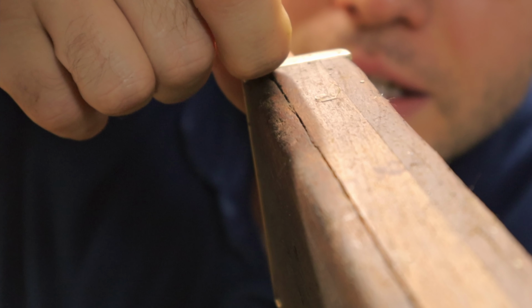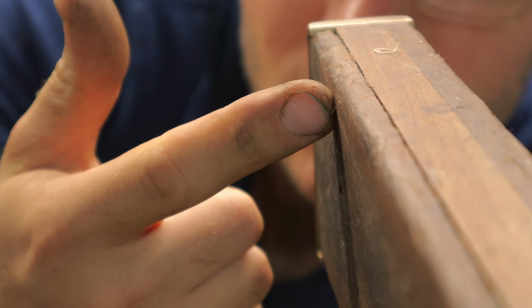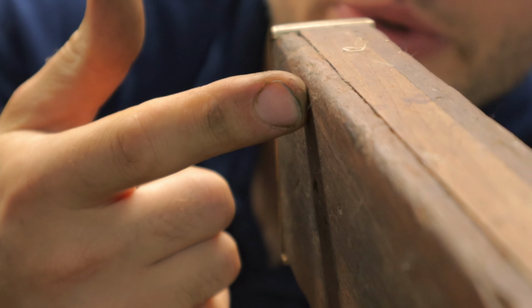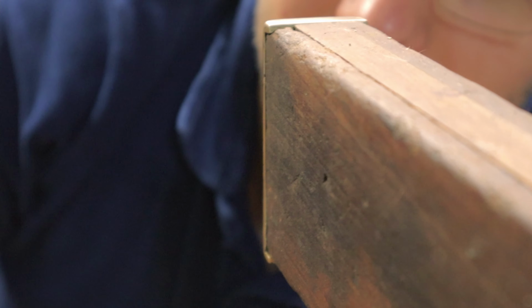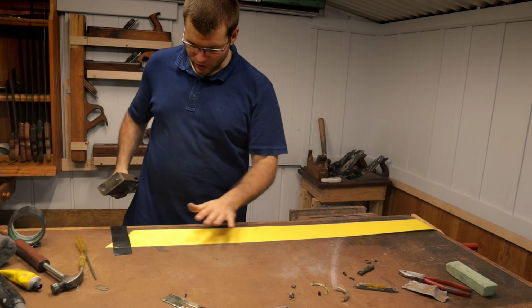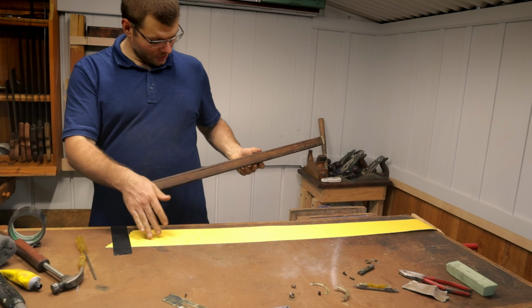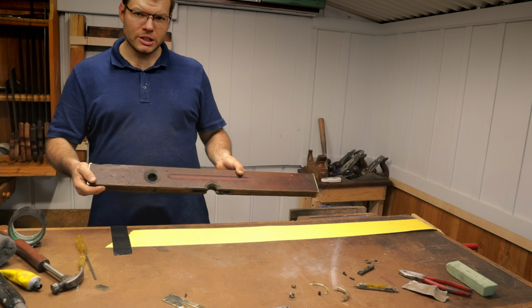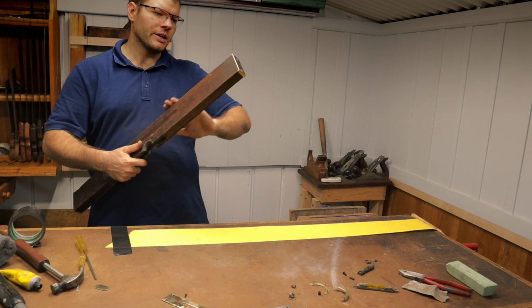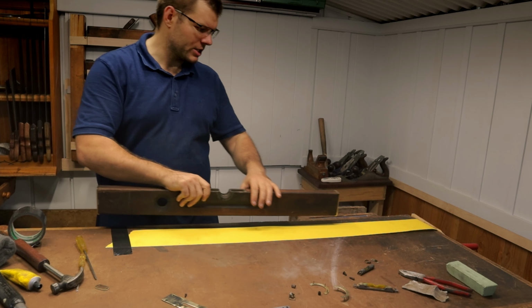You can see we've got some little overhangs where this front piece of wood is sort of worn down. So what I'm going to try and do is put a strip of sandpaper out and try sanding along it, because it'll take down both ends at the same time as the timber, and we'll try and get it to sit flat. So what I've got here is a piece of sandpaper just stuck down to the bench. This is 120 grit, and I'm going to proceed to rub the level back and forwards and actually try to bring any of these high spots out and just bring it all a bit squarer so it sits a little bit easier.